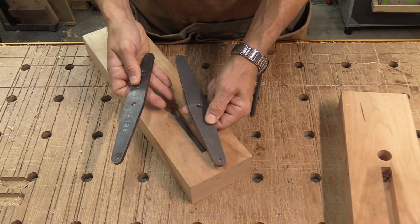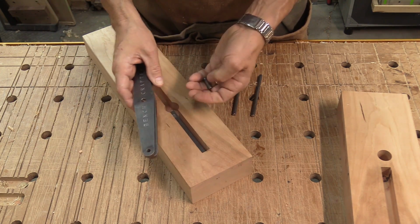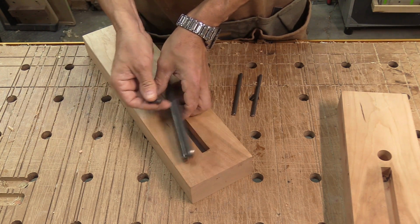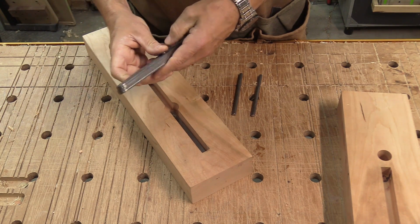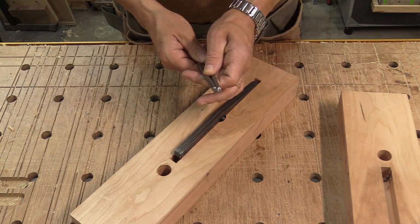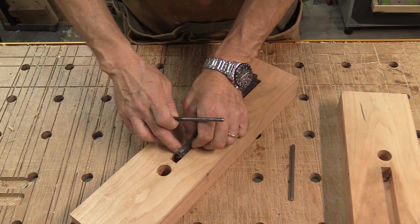So these are the two halves for the scissor mechanism. I'm going to make sure that both holes are on the top there. And there's a pivot pin that's included in the hardware kit, and it comes with an E-clip. You just want to put one of these on for now, and just put this on here, like so, and that's going to sit in this recess. Now, there's also these pins right here, and these hold the scissor mechanism inside that.